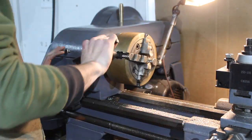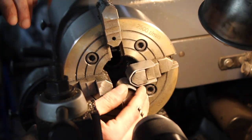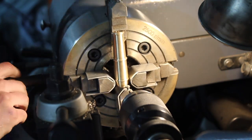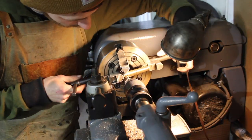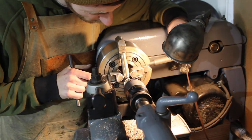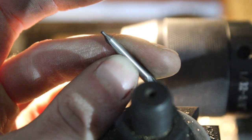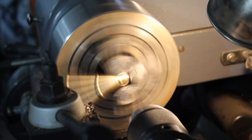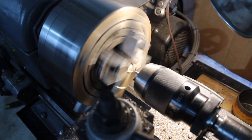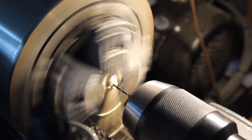Now I can swap over my chuck — I took the three-jaw chuck off and put the four-jaw chuck on. This allows you to mount odd-shaped parts, and I have soft jaws for this too. I wanted to bore the little hole in the back, so I got this as close to center as I could — I pretty much just eyeballed it because this is really just a prop, not anything that needs to be super precisely machined. I used a drill bit as kind of my center mark, and I have this little tiny center drill for my drill chuck. These are great for starting holes because they have a really narrow tip — a lot less likely to break, especially for small ones. Then once that center hole is drilled it's easy to go in with a regular twist drill.